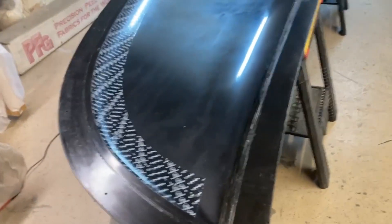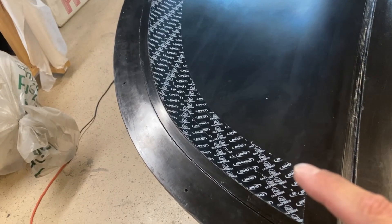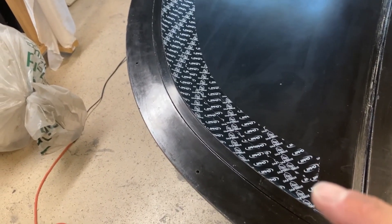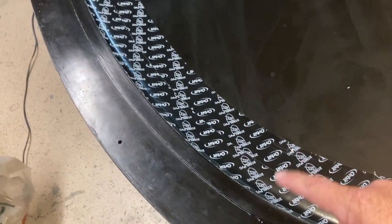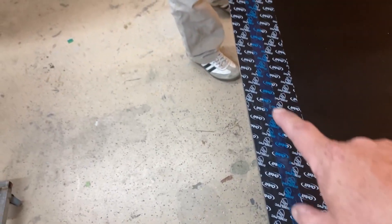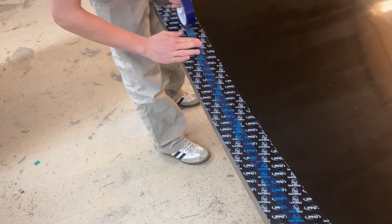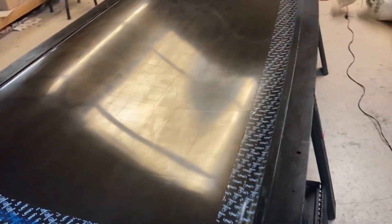The molds are in really great shape, so we decided not to polish them and we're just going to go ahead and start waxing. What I've done is taken two layers of 20 mil tape, four inches wide, two layers deep — so that's 40 mils, which is essentially even to about three-plus layers of carbon. This is going to get an external leading edge wrap, so this will create a little joggle in the tool. That goes all the way around the leading edge, and also at the center where I'm going to join the two skins. Ryan's putting flashbreaker tape over the center seam just to make sure we don't run resin down in there — it's really to avoid extra sanding in the part, a simple way to make it a little cleaner.